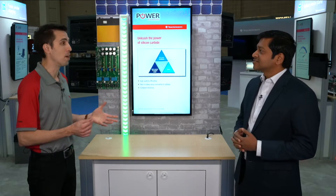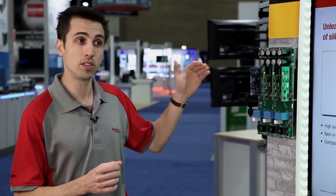Silicon carbide is a brand new technology that we've been seeing emerge over the last few years. The main reason people are choosing it is because of the high electron mobility it brings to the table, which lets you switch much faster. On this design we're going up to 50 kilohertz, which is over double what we traditionally see inside solar inverters. These FETs start at 1,000 volt capabilities — the ones we're using are 1,200 volts — so this high voltage rating lets us do 1,000 volt DC input with a single H-bridge for the power stage. We also have significantly improved thermal design on these devices because of their inherent properties, so we can get heat out of the system faster and increase system longevity.